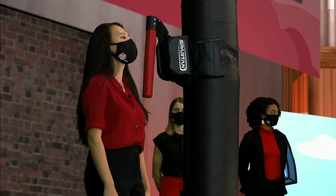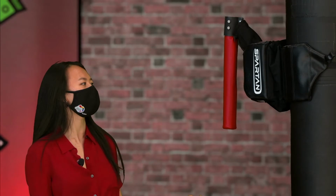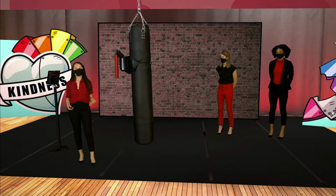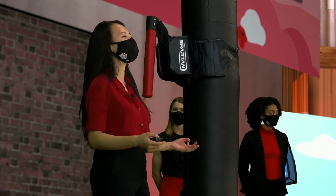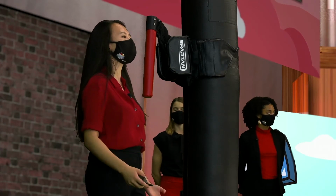We also designed Spartan to be fast. Spartan can punch twice per second, the same speed as a boxer throwing fully extended punches. To achieve this speed, we made our linkages and punch bar light, weighing just 350 grams, the same weight as a fully filled soup can. This allows us to get the fastest response from our servo motor.